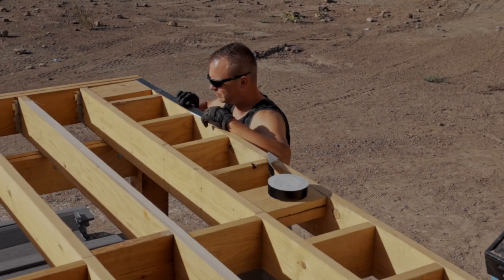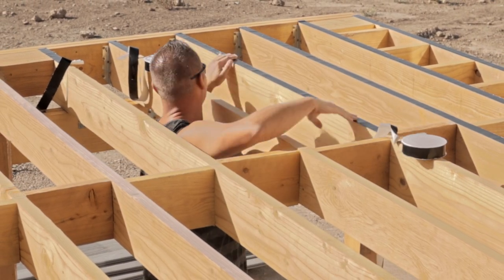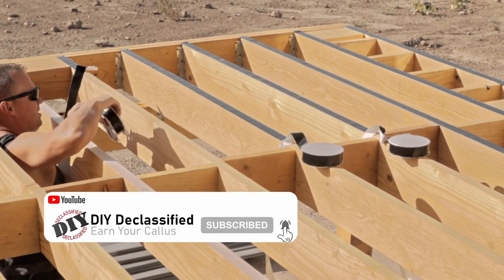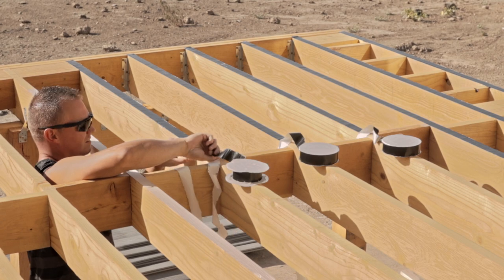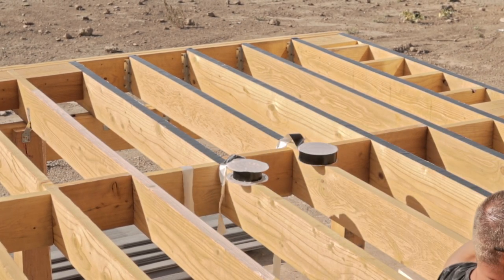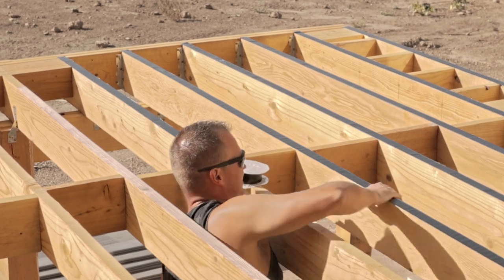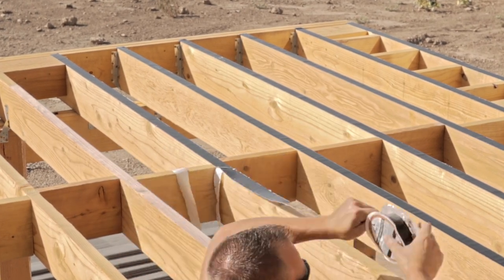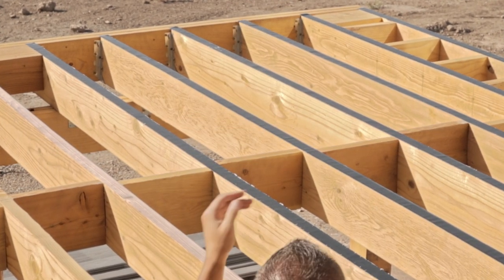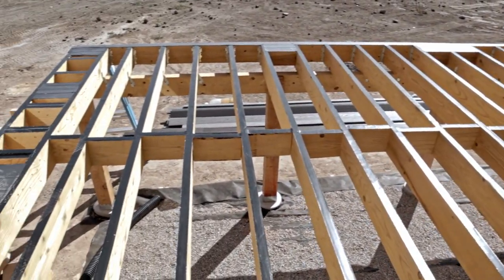The last step before laying down your decking is laying down a layer of butyl tape. Research has shown that around 90% of deck framing starts to split and rot around 8 to 10 years, but if you use composite decking it's usually warranted around 25 years — basically your decking will outlive your frame. Butyl tape acts as a water barrier between the frame and the decking material so trapped water can't soak in and rot the beams. Additionally, when you put screws into the beams it opens the wood for further water and rot, but the butyl tape will seal around your screw to prevent water from getting through. It's a simple addition that can add years to the life of your deck.